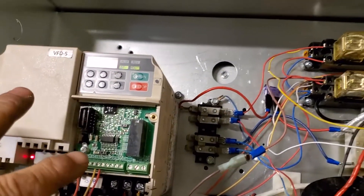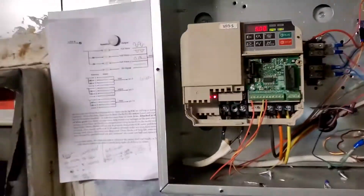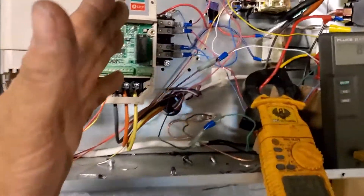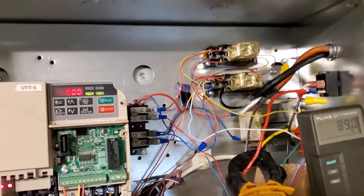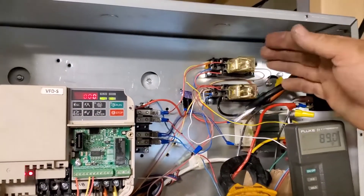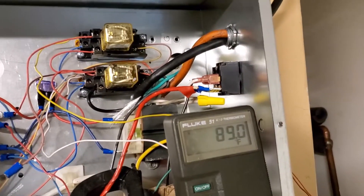This is my second stage. When it gets the run command, I programmed it for 50 Hz. I'm using a normally closed terminal there to hold the fan down to slow speed. But when it goes to high — like when the tank is less than 110 or something — I want it to go to 60 Hz and I want the fan to go up to high speed, fully loading it. Then once it gets within the last five or ten degrees, this will open, dropping it to 50 Hz and slowing the fan down to reduce the load on the compressor and let it heat up the last couple degrees.